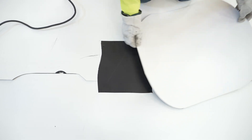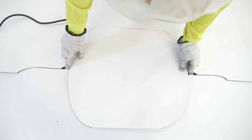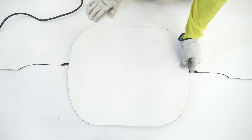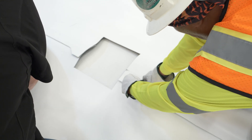Your patch material should be large enough to cover the hole, but small enough that it stays within any grind isolations along seams. Moving back to the area to be patched, leave about a one inch tab from where the patch will be placed, and trim back the seam flaps about 12 inches. Do this on both sides of the patch.